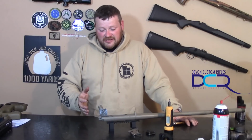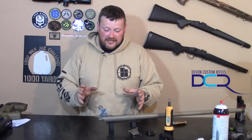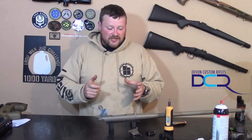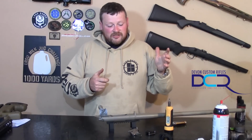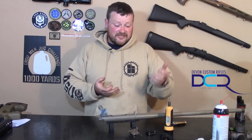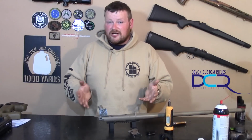But now, with it a good bit, it took a little bit to get used to, but now I really do like it. The only reason that it took me a while to get the hang of it was my Timney is set to a tiny amount of sear surface, because with the distance between the sear and the pivot point being so long, the only way I can reduce the pressure on my Timney was to reduce sear surface. Once all the pressure from the spring is released, sear is all you've left that you can adjust. So it's as safe as it can be right now, and I think it's sitting somewhere between 8 and 12 ounces. It won't go any lower safely.